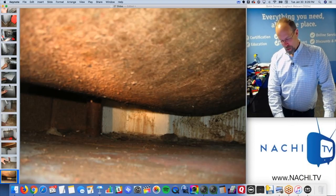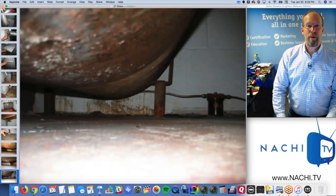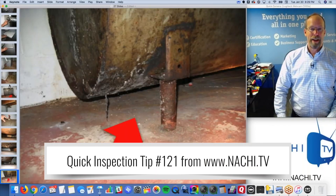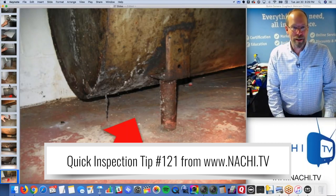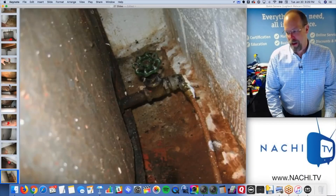This is not a good indoor air quality issue - this is a bad one. A lot of homes are not healthy. I like to tap on the metal legs to see if they're deteriorated, and often in my experience they were. This tank is leaking. It's wet with oil, it's dripping, it's rusted, it's black on the outside. There shouldn't be any oil on the outside of an oil tank unless it's leaking somewhere - like a pinhole. Oil filter, just like on a car. Oil valve, so you can turn it off.